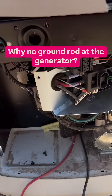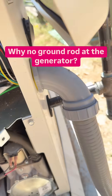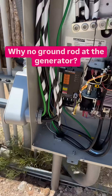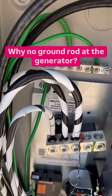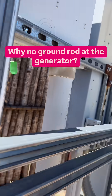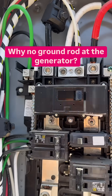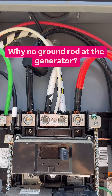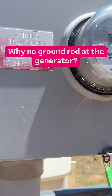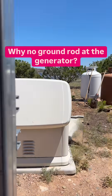Then how do you do it? Well, the neutral from the generator is connected to that neutral bus, which is connected to the neutral conductor. Follow this — we're going to get to the Earth in a minute. Over to the neutral coming in from the generator to the neutral bus of the transfer switch, travels on the neutral conductor, going back into this equipment here, connects there at the service neutral, which is grounded — main bonding jumper there — and that's how we make a connection to the Earth. We do not drive a ground rod.